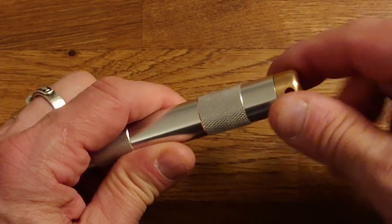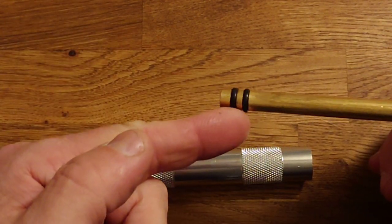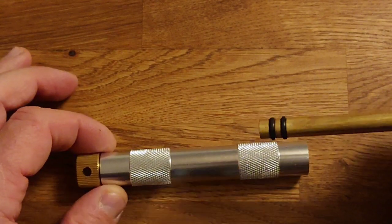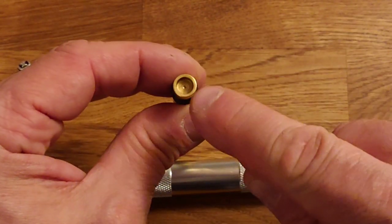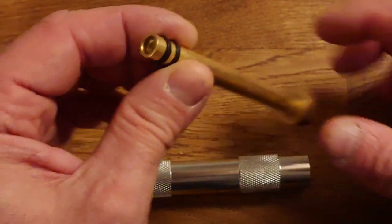This end, that knob pulls out, and as you can see, we have a pair of o-rings here. All these o-rings help to keep the air contained within the cylinder when the piston is being pushed down. If you look at the end of the cylinder, you'll notice there's a recess, and that's where we put our char material.